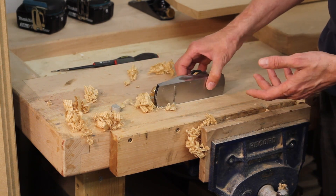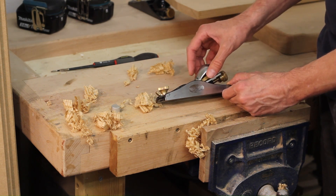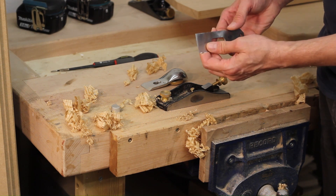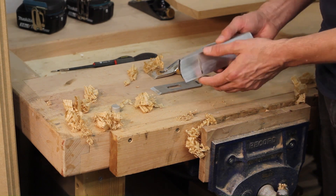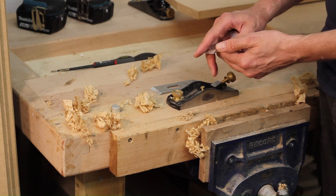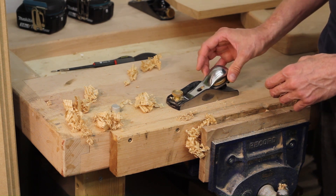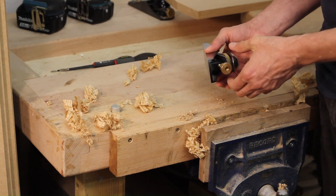All in all, after a bit of work, it's actually quite a nice tool and well worth the money that I paid for it. I've been using it for quite a while now and the blade seems to be holding its edge, so I imagine the steel is quite hard. The cap iron fits really nicely into your hand, and it is quite easy to adjust and take the blade out to sharpen.